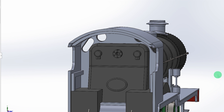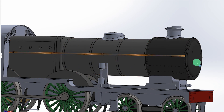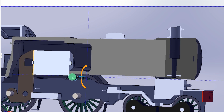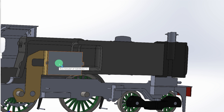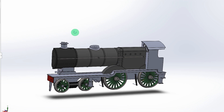You can see the bolts on the print, although I have to take a photograph and zoom in to physically be able to see them — they're too small to see with the eye. I've also added the saddle and a little extension for the piston valves into this print, just because I thought, why not? But the main difference has been internally. If we take a cross section through the model, whereas the boiler previously was a hollow tube, I've essentially filled it up — just to make it stronger, basically. But I've kept enough of a cavity inside to take the motor and allow the motor to raise up slightly on its gearbox, as I discussed in the last video. So quite simple modifications, but I hope they produce a better outcome.